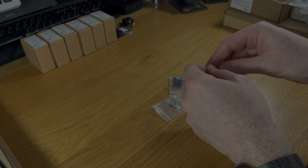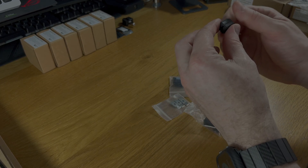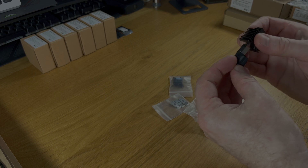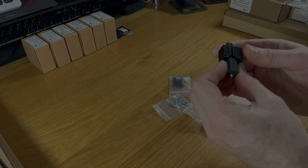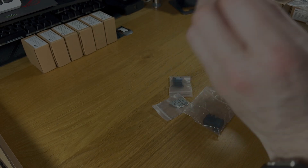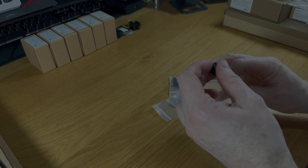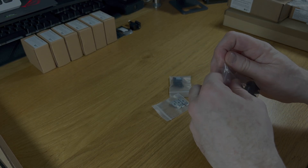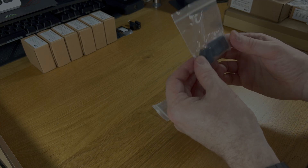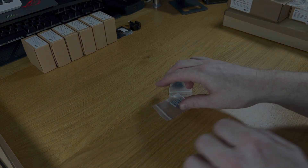You also have the socks. These again are consumables — they are for your hot ends. You basically put your hot end into one. I think you should keep a stock of three of these; it's no harm having them. They're not that expensive, and if anything happens to the socks on your hot end you can replace them quickly and get back up printing. So definitely keep a few of those around.